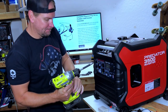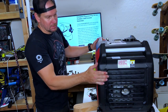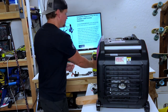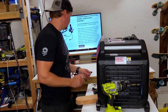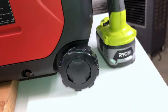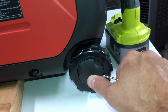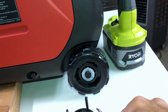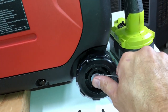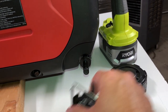These ones do come out. Next take this panel off — it's the most involved one, but you've got to take these three screws off here in the back. You do have to take the wheels off. These are fairly simple — the little hubcaps off will reveal a cotter pin, pull that up and out, keep it inside the hubcap, and a washer — keep that inside the hubcap as well — and the whole wheel just pops off. Just keep that aside.